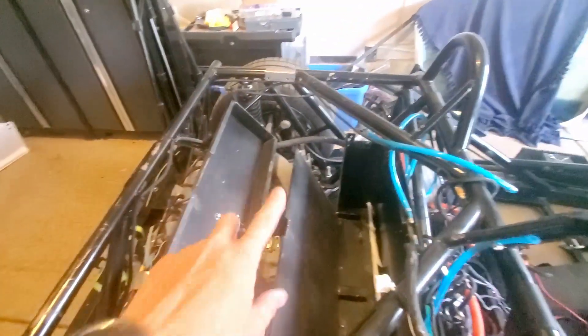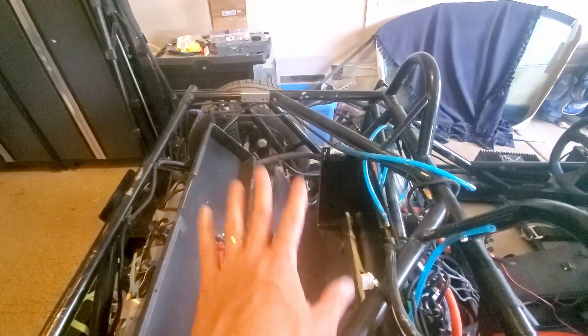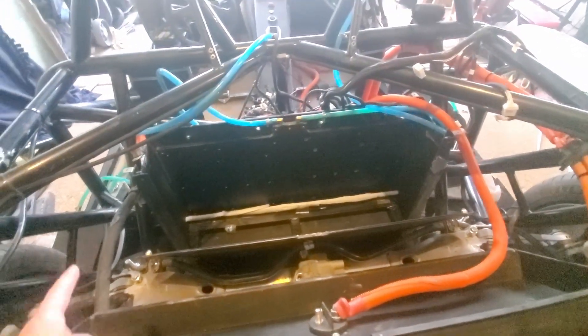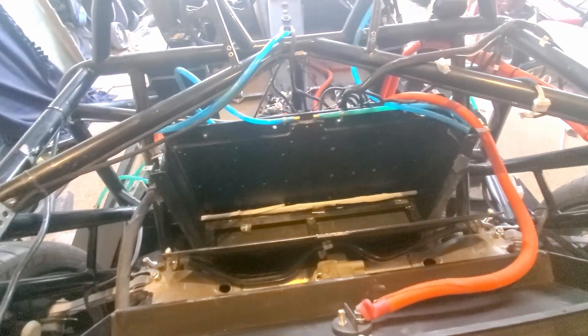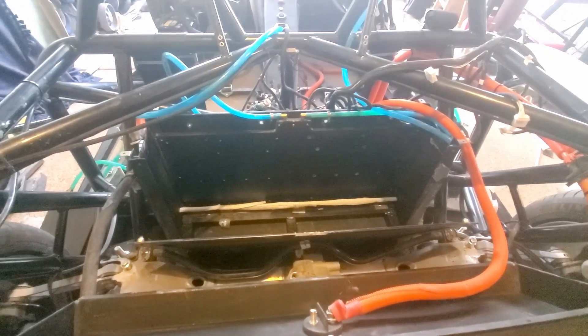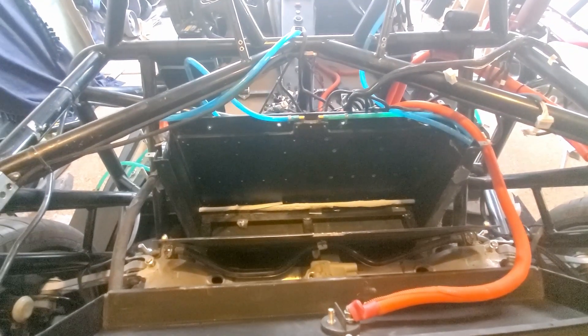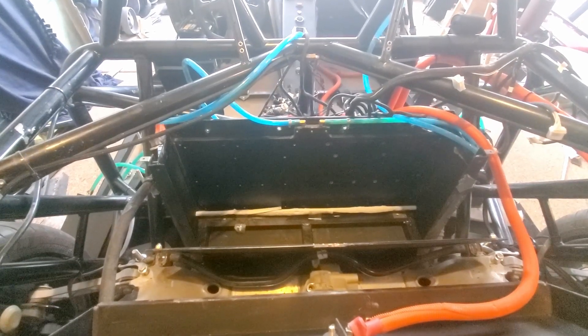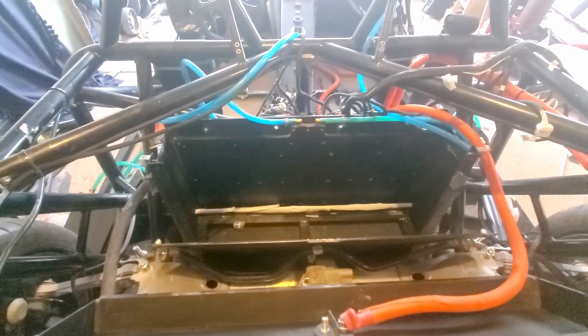Pack 2 is out. I took the battery tray off - the two battery modules were on the battery tray, took those off, took the tray off, opened up the access panel, and took the other batteries out. I removed all the thermal paste. To get good thermal conductivity I had put on thermal paste, but thermal paste is not electrically insulated - so I think that was causing some of the issues. I'm going to switch to thermal pads, which are used in electric vehicles and are also electrically insulated.